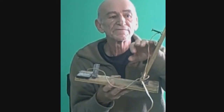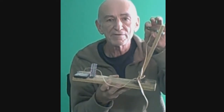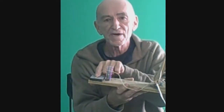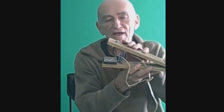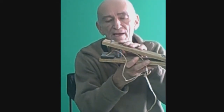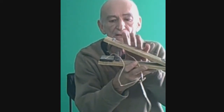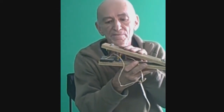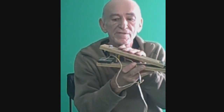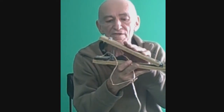I have one wire connected to the ground on my quarter-inch jack, and this wire connected to the hot. When the jack is in the DM5 and I make contact, I have a sample shift. When I release contact and the circuit is broken, it shifts to the other sample. So when I press it down I'm playing closed, and when I release the pedal I'm playing open. It's very simple.